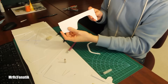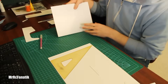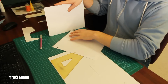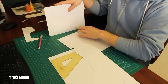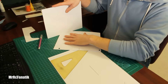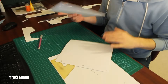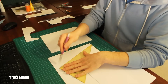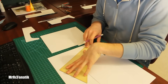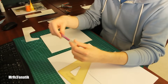When I put one of these on, it retains the original size. When you come to the back, you can see this one's larger. One of the tests you can do to see how precise your cut is: push it down onto a flat surface and take a piece of paper and try to shove it underneath — which doesn't seem to go. Then put it like that and pull on the paper — you can see how it's moving the plastic. The thickness of paper is still too thick, and that's exactly what you want: something nice and straight. To get a nice straight cut, use the straight edge and lightly cut through. You don't want to press too hard because the blade can dig in and move even with the straight edge held down, and you'll end up with a wobbly line.